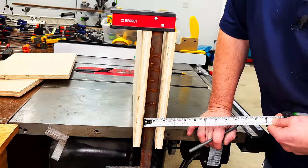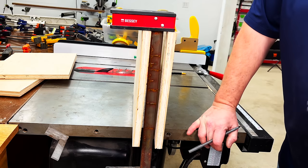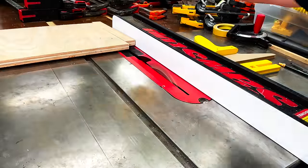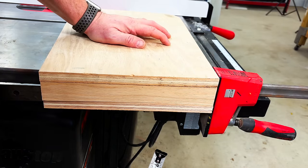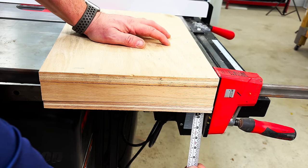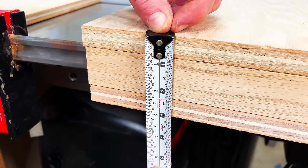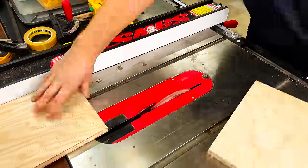With two pieces cut to shape, I'm placing a clamp in between the two pieces to figure out the width I need between each board — in this case it's an inch and a half. So back at the table saw I'll set my fence to an inch and a half to rip some strips to place between each support beam. With a few strips cut, I can place them between the two boards to figure out how much overhang I want for the French cleat system — about three inches on each side. Since the width of our clamp rack is three inches exactly, that means we need to cut some nine-inch strips for the French cleat backers.